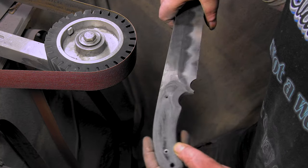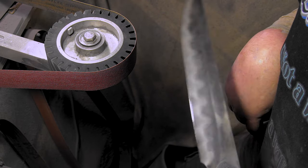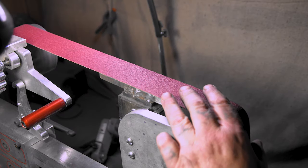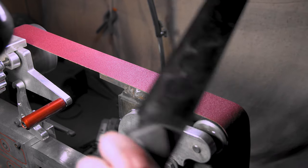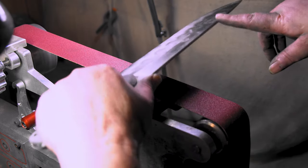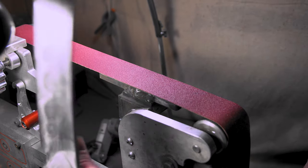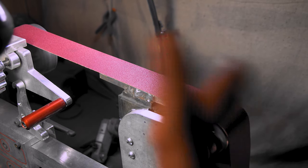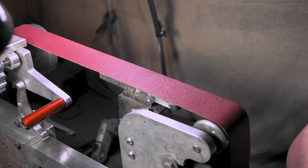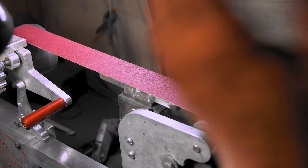The rest is hand sanding, then sharpening, since I'm not doing a sheath for this. All right, I've got my grinder set up vertically, got my platform, I'm standing up. I'm like 6 inches in the air. I usually use the prop up 1 foot. Anyway, I haven't finished the handle, but I figured I'd go ahead and sharpen it, because I can take these handles off and they just need hand sanding. Let's do it. Got a 120 brand new, and then I'll go up, we'll see how high we want to take it. If you follow me on Instagram, I put a shim in here. The belt's running backwards, so now everything lines up real nice.